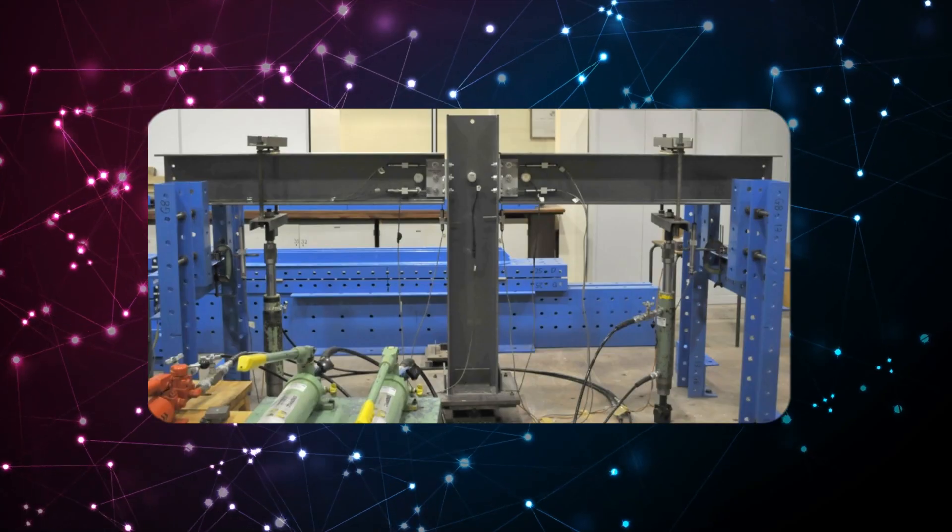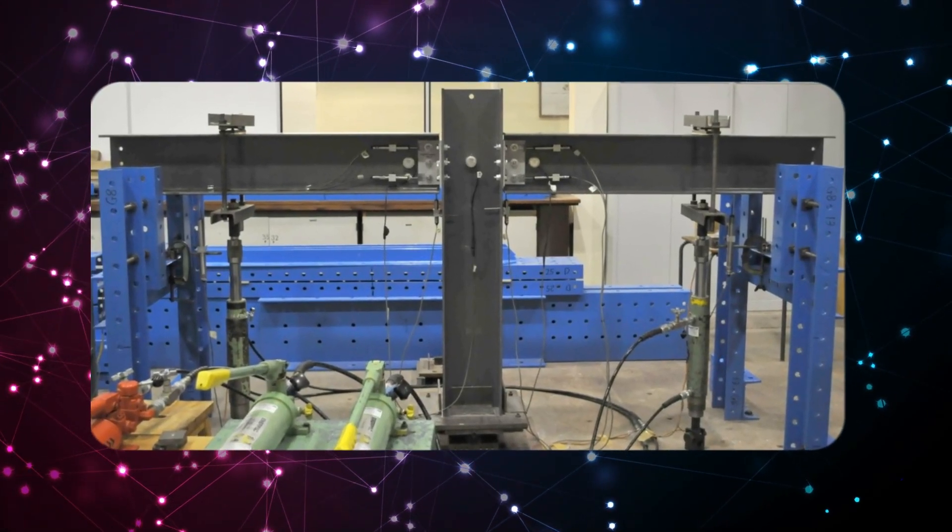These are desirable properties for bridges. However, a major factor preventing wider use of FRP is the lack of understanding of joints. Bolted joints in FRP bridges lose tightening over their lifetime.